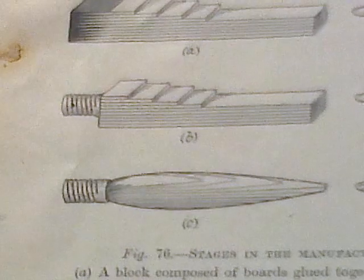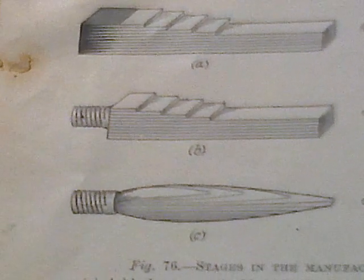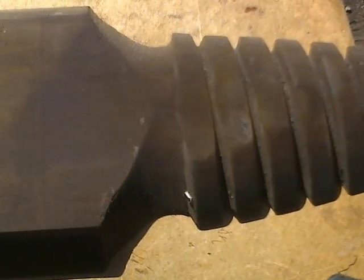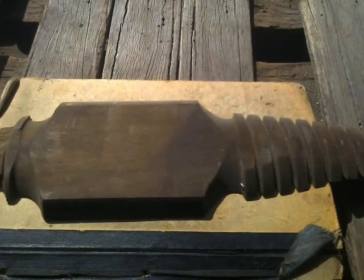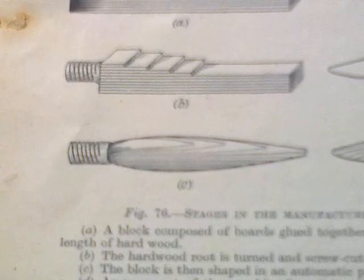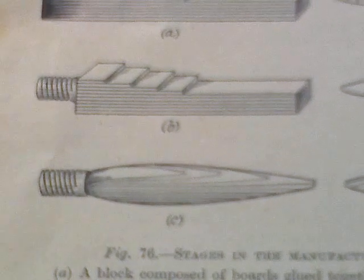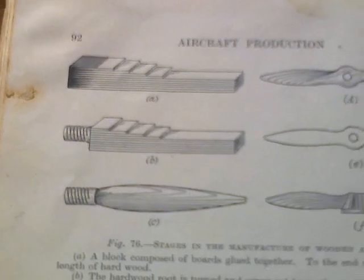However, the funny thing is that as engines became more powerful during the Second World War in both Britain and Germany, designers turned to wooden laminated blades, some of which were pressure impregnated with phenolic resin before the laminates were glued together. This is a piece of resin-impregnated black walnut which came out of Sydney University in about 1939, perhaps 1936, when a local by the name of Neville Fakes was on the first course to study aeronautical engineering in Australia. Today in 2019, if you're restoring a Spitfire, Messerschmitt, Focke-Wulf, Hawker Hurricane, or perhaps a Lancaster, you've got to go to Germany to get the laminated wooden blades for their Rotol propellers.